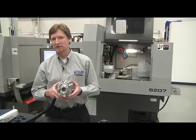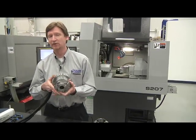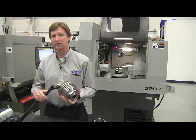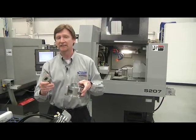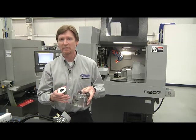To change over from Swiss type to non-Swiss type, you're going to remove the rotary guide bushing from the machine. The rotary guide bushing is held in place by six socket head cap screws and generally has some other components plugged in. After removing that, you will install the chucker kit, which will allow you to bring the headstock up into the machining zone to machine shorter workpieces and get a much shorter remnant. When workpieces are shorter than a three or four to one ratio, it's much easier to machine them without a guide bushing — you don't have to use ground bar stock, you're going to have shorter remnants, and tighter concentricities and roundnesses on your part.